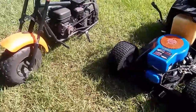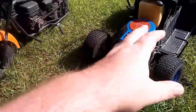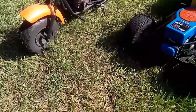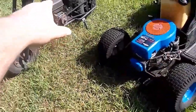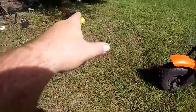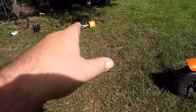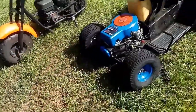I think it'll turn out real nice and run real good. You would be amazed what these little motors will do with just a pulley swap. This one has a five-inch pulley on the bottom — that pulley will end up under there. That rear end right there has a six-inch pulley on it now; it will go down to a two-inch pulley.